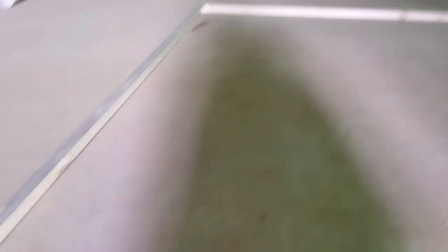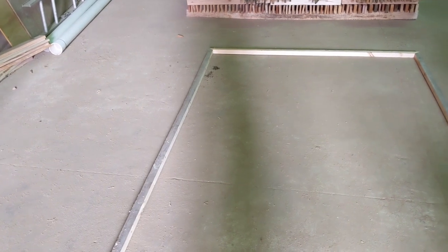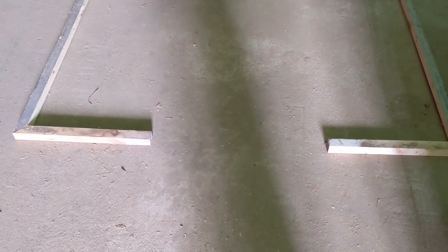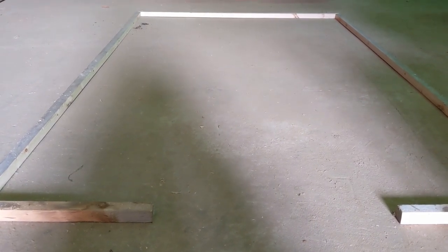This is the rough top part of the frame — solid along the back, roughly two foot from corner to end, same on the other side, which will give me enough room to make that two-foot doorway again. Solid piece going ten foot back. The outside dimensions are going to be six by ten, and the inside will be probably about four inches shy of that. The very bottom of the framing will be solid up here. I just want to run the PVC and things like that so I can get a rough idea of the actual end height and make sure the door frame is squared away and correct.